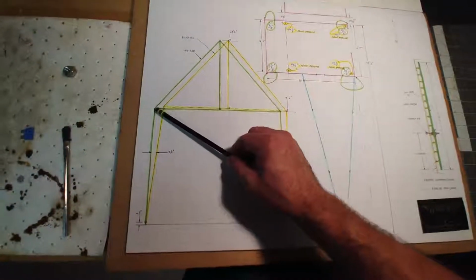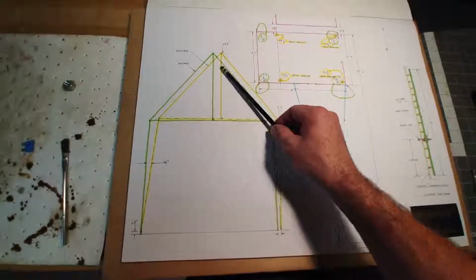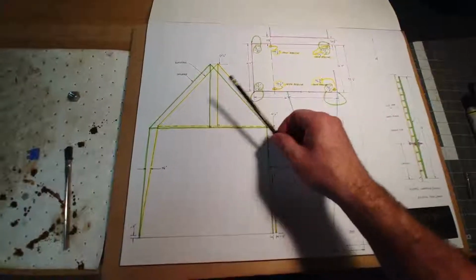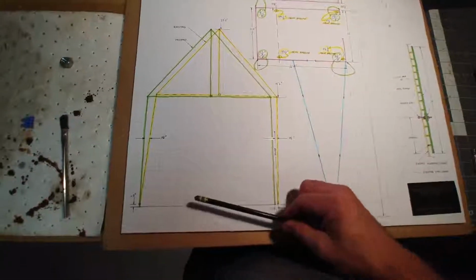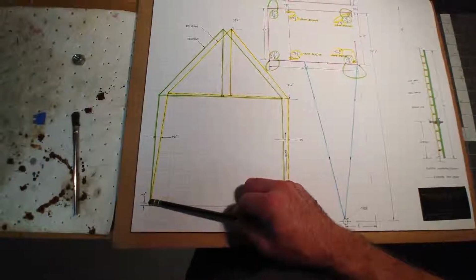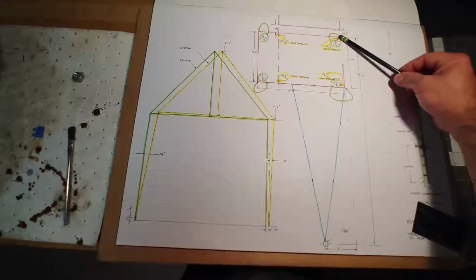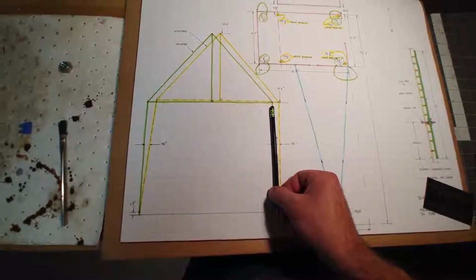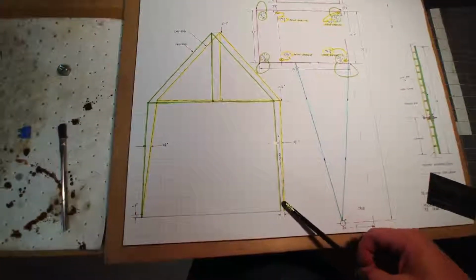It's very desirable, quite plumb, and the triangle roof system, those can't change because you can't rack a triangle. There's no degrees of freedom. They're a fully justified closed shape. So then I plotted up 3 inches over here and over the 4 inches or so that it has migrated at this corner, and I took the green measurement for the wall as well as the distance out of plumb at 8 feet to scale.